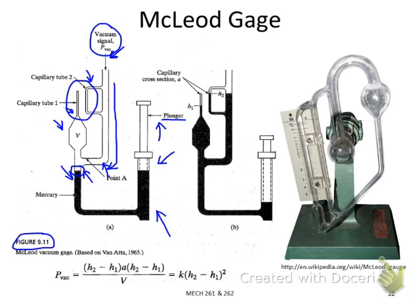So you can imagine this source will pump out most of the air inside here. So the air will be pumped out, and finally the pressure inside will reach the same pressure as the P vacuum. So that's P vacuum. Okay, so let me remove those marks. And once we reach a low vacuum state in this chamber, what we do is we push this plunger